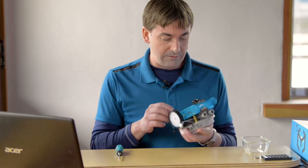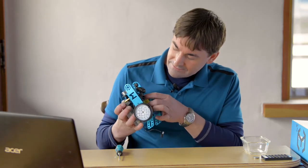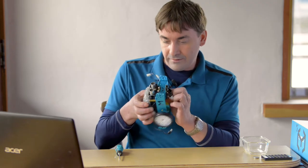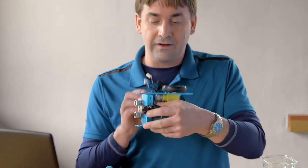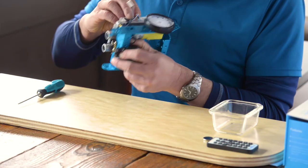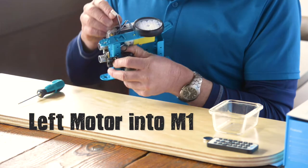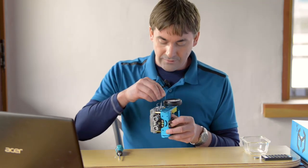In step 29, look at the bottom and determine which is the left side. Follow that little wire up — it helps to pull on the wire a little so you can see which one it is. We're figuring out which is the left side because it needs to plug into the specific side of the motor controller, which is M1 and M2. Click that one in gently, because there are just little metal pins in there, then click the other one in — M1 and M2.